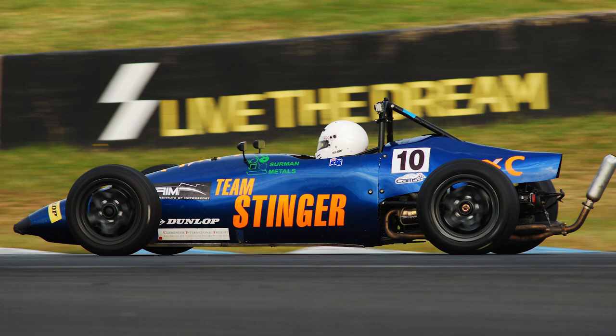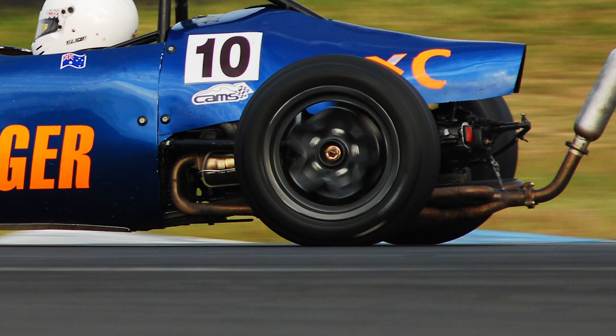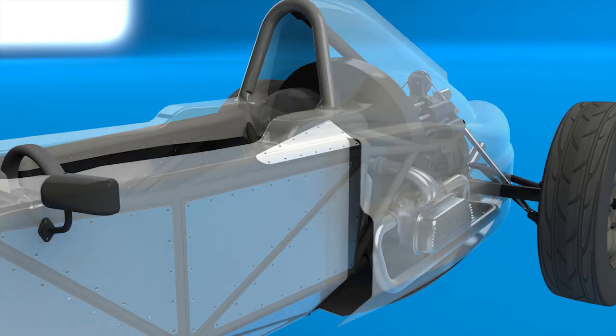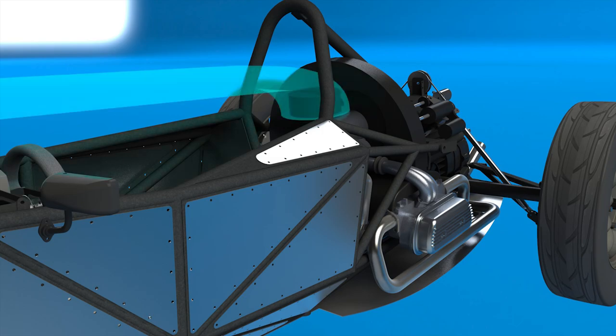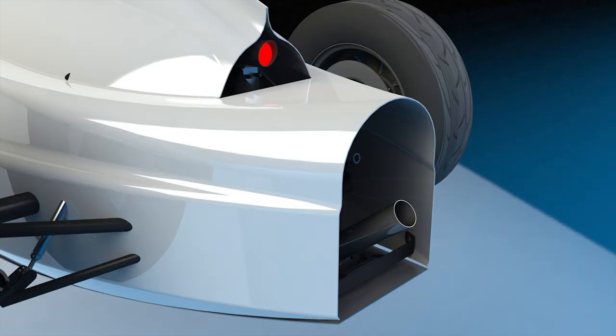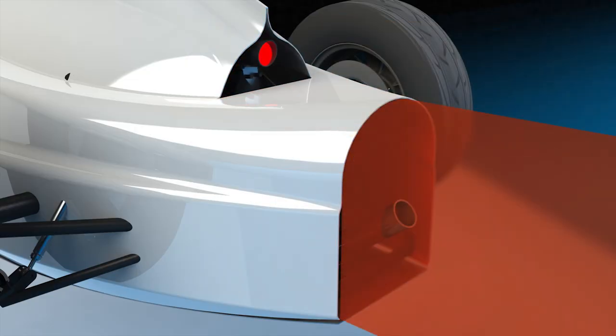Most Formula V cars don't enclose the engine as it is air cooled, so you can't really just put a radiator in a convenient location and call it a day. You need to make sure that the engine gets enough air over it to stay cool. These are the intended flow paths for the air — I'll use ducting to direct the air as necessary to the carburettor, the fan inlet, the oil cooler, and the engine heads. The air is then directed out two holes in the rear.